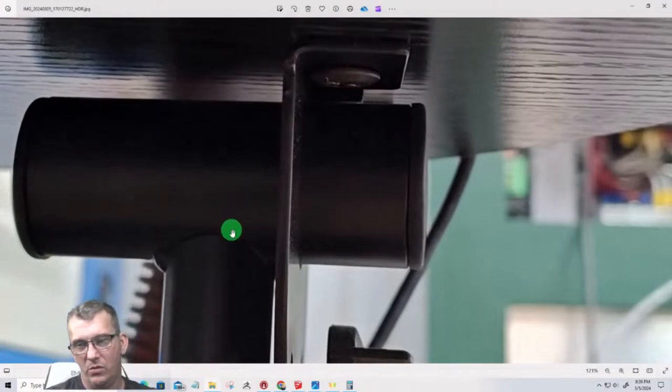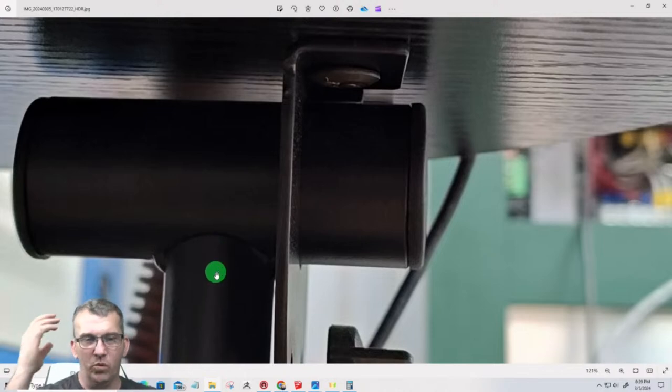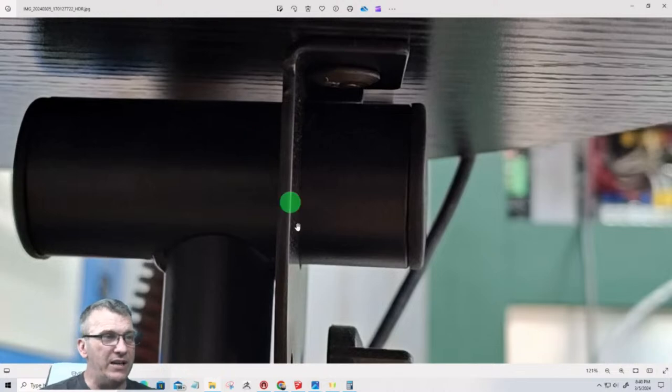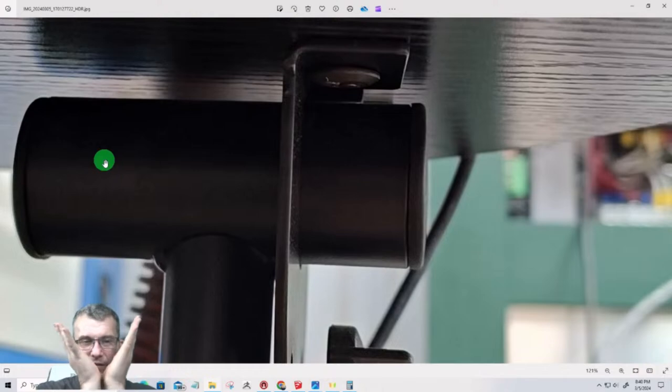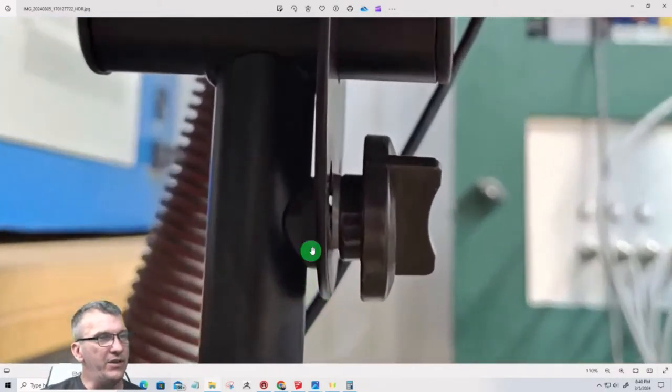I want to make this out of wood, really nice wood and everything. I can recycle the bracket. That's not a problem. But I am going to use wooden dowel. So 7/8 inch, 1 inch. And this short dowel here, I'm going to literally put it in a V-shaped jig, clamp it to where it can't rock or roll or anything. And I'm going to have my CNC cut that 7/8 of an inch, so the two parts can be glued together. There's going to be a threaded insert into the side of this shaft where it'll line up with this bracket.